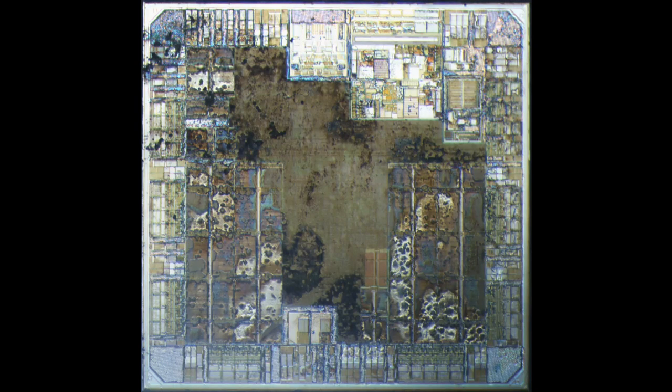In this picture it's a little indistinct — I only partially etched the metal — but we can see the theme: a bunch of boxes sitting on the edges. Each of these was provided by the vendor. So if you go off and do semiconductor design these days, there's no need to design a USB plug, no need to design power supplies, no need to design I2C and I3C — you can buy all these blocks from the vendor. These are I/O pads. They're fairly complicated things to design, and once designed the vendor sells you the IP. It's placed into the design — it's called a macro block, because not only do they provide a schematic, they actually provide the physical layout. It's basically just dropping in components.